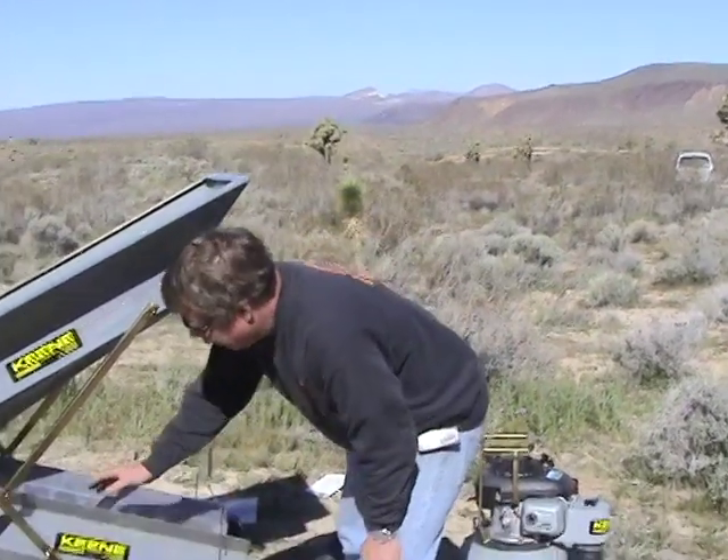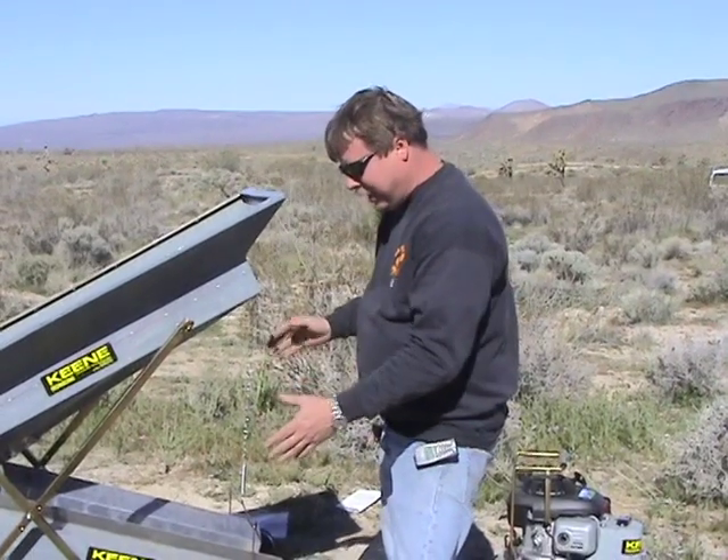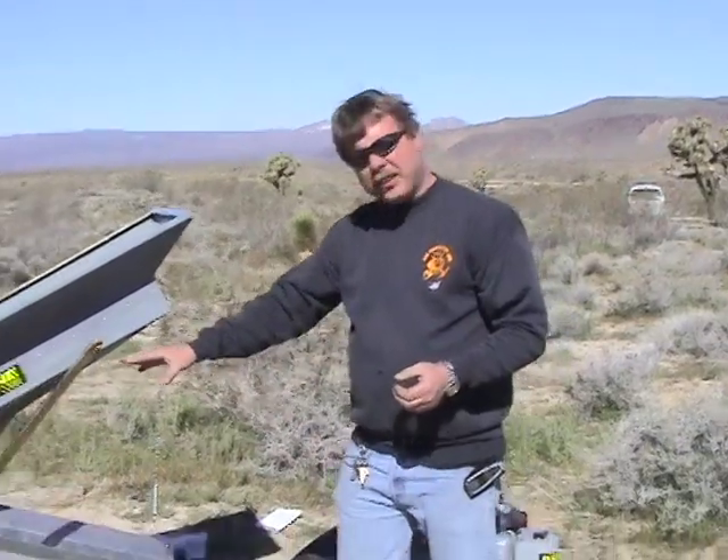That electrostatic charge actually works like a magnet to the gold. When you put your arm near the machine while it's running, you can watch all the hair on your arm stand up as the electrostatic charge draws it to the box. The fine gold particles that get concentrated throughout the tray receive an electrostatic charge, which allows them to stick to the special cloth inside — made of polyester and rayon with a nylon board underneath. When the hot air pumps up through the bottom and passes that plastic, it creates quite a charge — in fact, you can get a little zap from the box once in a while.